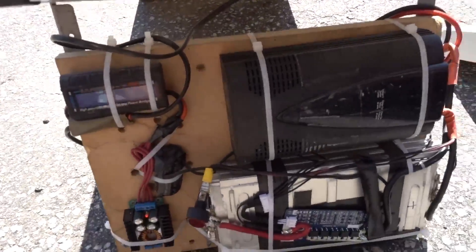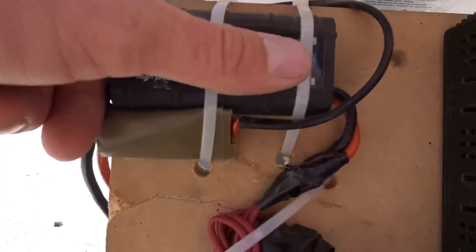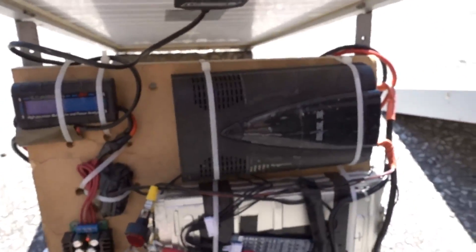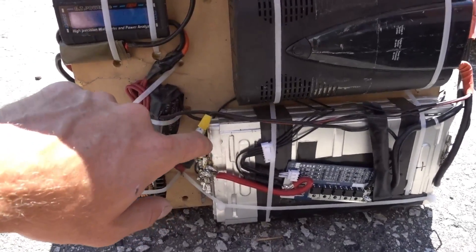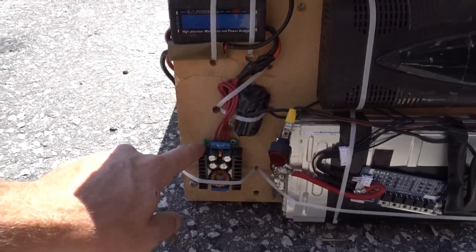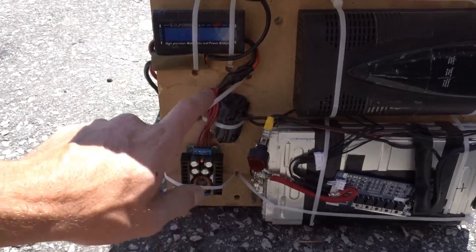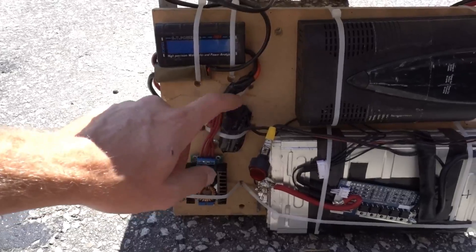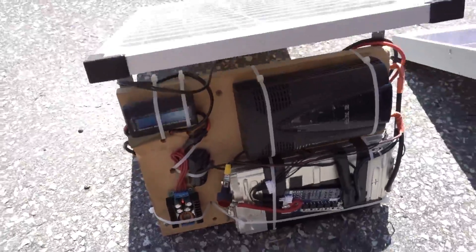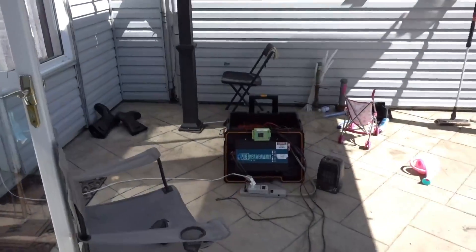This is a little thing I made a long time ago — ugly, but it works pretty good if you want to run like a whipper snipper or something. 600 watt inverter. What are we making power-wise? 20 watts, 12.3 volts. This is one of those EV batteries, it's a 2P3S — works very well. Little buck converter, that's my charge controller. Have it set to 12.4 volts limit. I've got a capacitor in line before it goes to the BMS just to clean it up because this pulses.